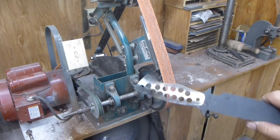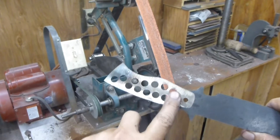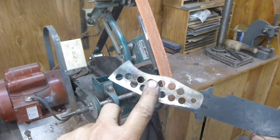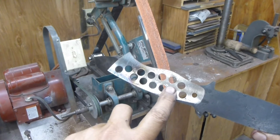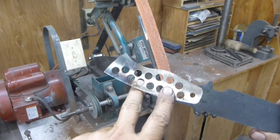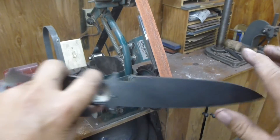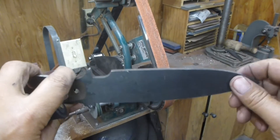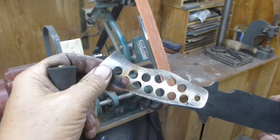The way I do it is I start off with a regular straight blade. I drill all the holes out — it lightens up the handle some, but it also removes some of the metal that you need to remove when you taper the tang, so it does double duty. Also, when the knife gets lighter weight in the handle, you're going to take some of the blade out when you start grinding it anyway, and then you add the handle on — this really helps to balance the knife.